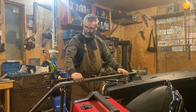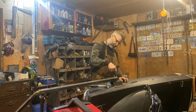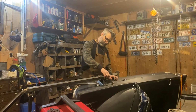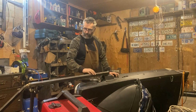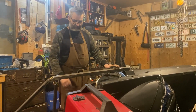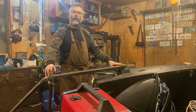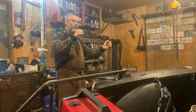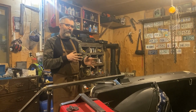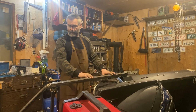So I welded the steel here, put extra support on the axle. I don't know how to call that really, but the axle bolt, I put a way bigger one, more steel here. And it's not perfect. Ideally we'd put steel all the way, but I feel that that long bar was actually a weak link. As a torsion when we take tight turns, that thing keeps bending slightly, and it could be some metal fatigue years after years. So that's why I put a little bit of extra steel here.